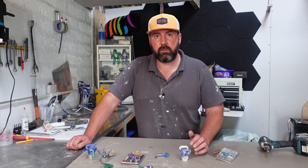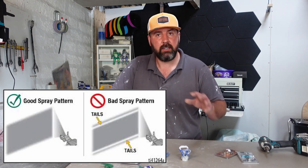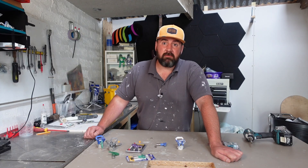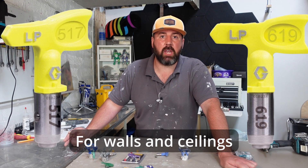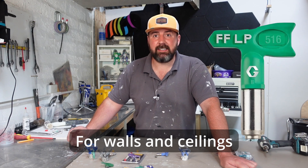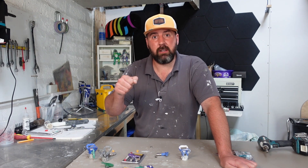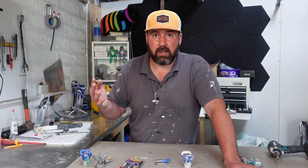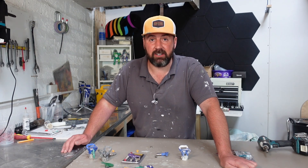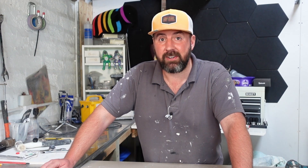That just solves the problem for those trying to use blue RAC X tips for the Graco then swapping to green and wondering why they're not getting a nice fan - you won't get a nice fan if you're not using the right seat with the right tip. My recommended tips are a 310 for woodwork to get you going, and anywhere between the 517 it comes with and a 619. Sometimes I like to use a 516 - it gives you a slightly slower pace than a 517, a finer finish. On domestic properties you have a little more control, and sometimes it's not best to just smash everything out. Tip-wise I hope that's covered some of your questions - pop anything I've missed in the comments below and I'll get back to you. Hit the like, hit subscribe - see you in the next one.